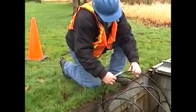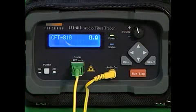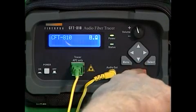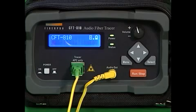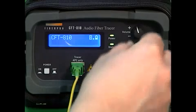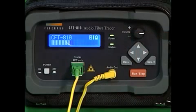The sound is monitored through a headset or earphone connected to the instrument. We are now ready to begin making measurements. Start the laser by pressing the RUN-STOP key. The instrument will complete a five-step configuration process, during which time it's important not to tap the cable or disturb the fiber-optic jumper. When configuration is complete, the volume control knob is used to adjust the sound level in the headset, as well as the sensitivity of the bar graph displayed on the screen.